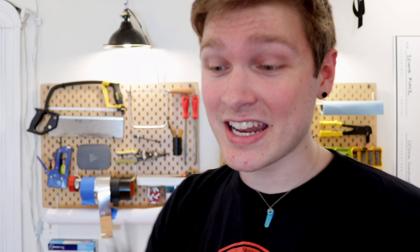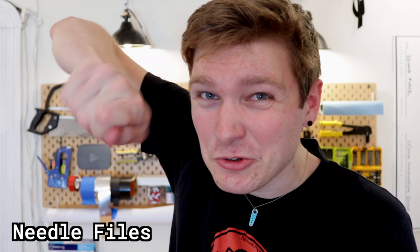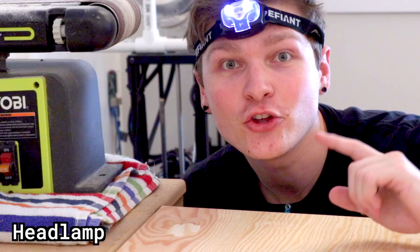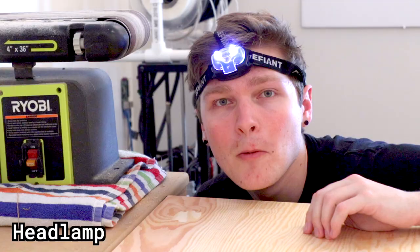For finishing work I highly suggest getting a set of mini files. You'd be surprised how useful these become. Whenever I'm CADing I always forget to leave a tolerance, and parts don't always come out the size you determined in CAD, so I usually have to sand them down — and these get super useful in tight corners and getting stuff flush just how you want it. Also, when using those files, light is the most important thing. Buying a headlamp changed my life. You look like a total idiot but it doesn't matter — please trust me, buy one. I have three.